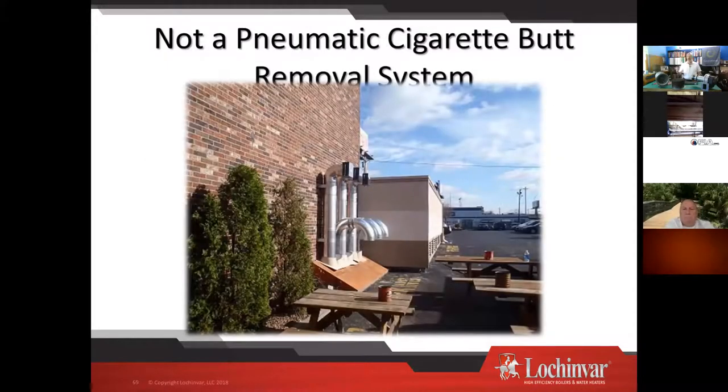As a maintenance item, the air intake filter does a good job — just picture how many CFMs we're pulling with the bigger boilers. Don't have a smoking section right by the air intakes. Think about where they're located — we have a school installation where the air intakes are right on the front walkway. Any sand or debris the kids throw in goes straight into the burner. Make sure the intakes have screens because anything that gets in the air stream ends up collected in your burner.